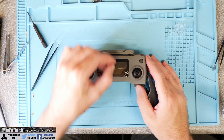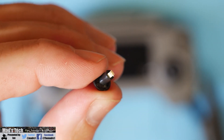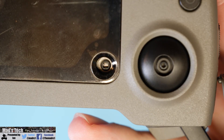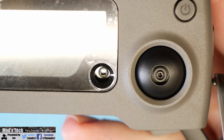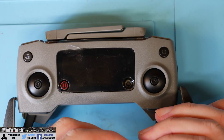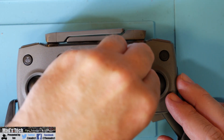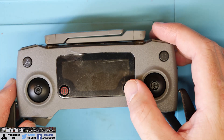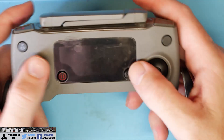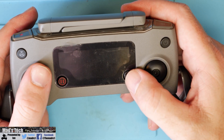The last thing to do is fit the 5D button. On mine it actually pulled out the shaft out of the button assembly. This isn't actually broken and it will push back in, however it goes in a bit looser than it was originally. What I did was put a little bit of silicone on the bottom of the piece and then placed it into the hole, pushing it in so it slots in correctly, and then allowing that to set just to hold it in place over time - and my button is working absolutely fine. It is worth noting that when you take this off it might look like you've broken it, but if you're very careful you can actually put it back.